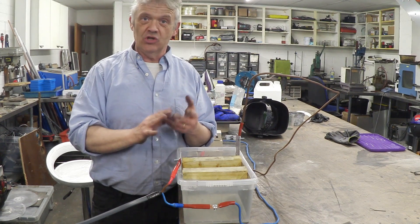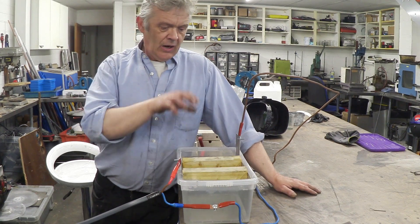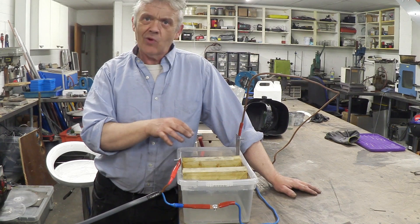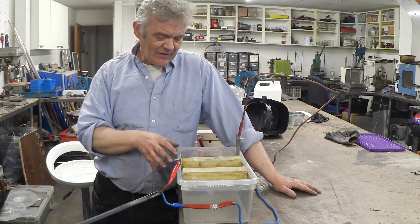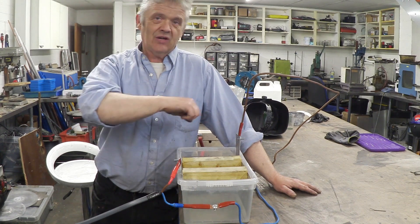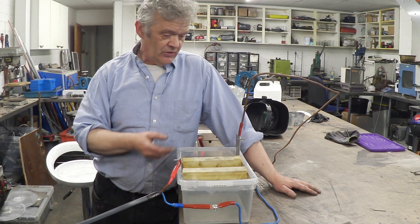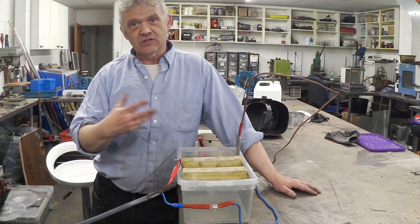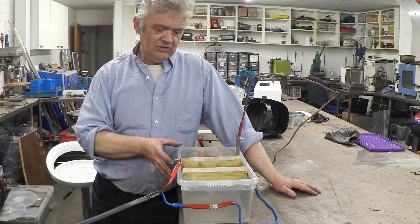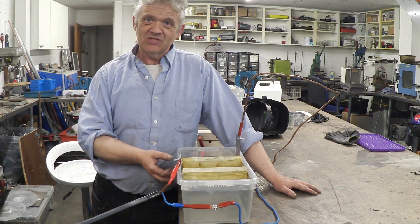Aluminium, copper, and steel will all work just fine. The power is dependent on the size of the plates — here the plates are fixed, so there's no variation in power. But I've actually seen this setup used as a variac: if you can slide one of the plates in and out with a lever mechanism, you can vary the voltage. So this thing is not only a transformer isolation device, it can also be a variac. But that's all you actually do — set up your bucket of water. I just thought that was fantastic, really. How simple is that?